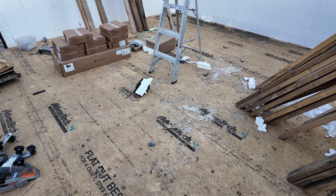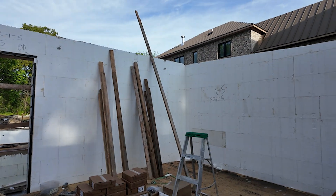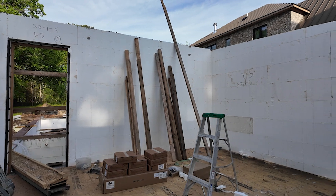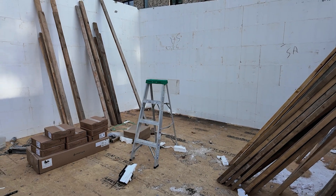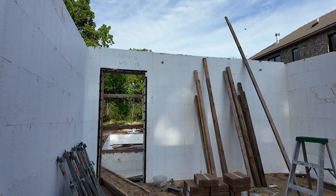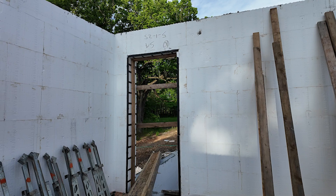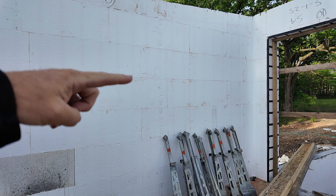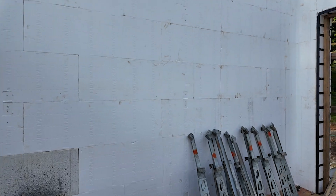This is a pretty cool way to go — you frame the floor while you're building the ICF, and then when you pour, the very next day you can be setting walls and ceilings. I've always found it to be the most efficient way if you have a crawl space. Just send a guy under the crawl the next day to tighten up the anchor bolts and you are off to the races. This element thing — we poured about 15, almost 16 feet at this side, all in one go round. In the second pass I got it all the way up to about 12 foot deep in about the first 20 minutes of the pour — that puckered me a little bit, but nothing happened. It held up really good. These element blocks are fantastic.